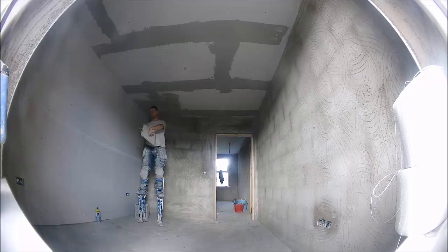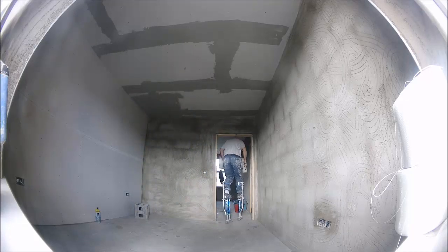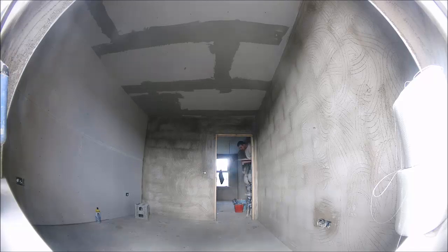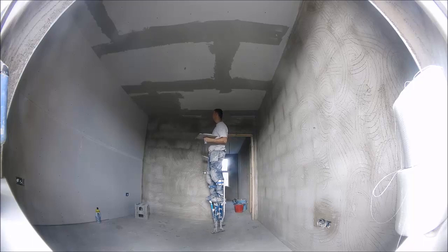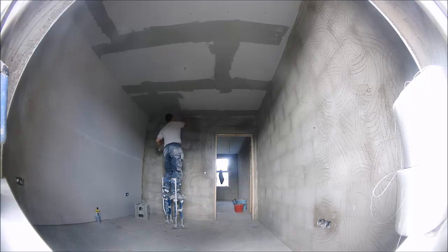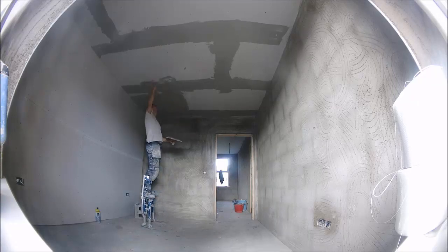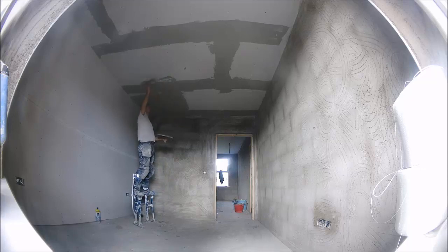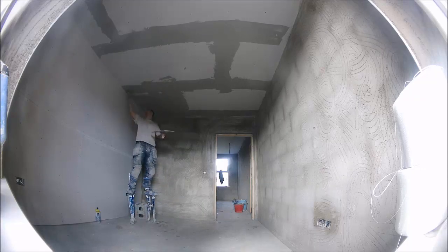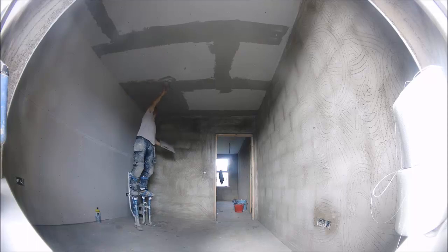What you see me doing now is the first coat. Your first coat should be about one to two millimetres thick, and with two coats your overall coat will be approximately three millimetres — so it's not very thick at all. It is just a skim coat and it's called a skim coat for a reason. Some plasterers call this the scratch coat because you're scratching it on very tight. There are loads of methods and loads of ways to do it wrong as well.